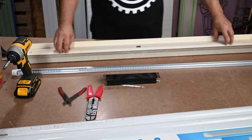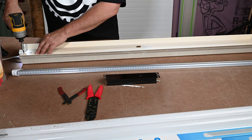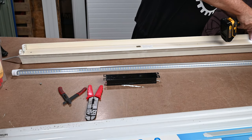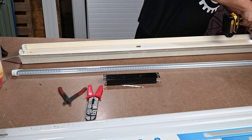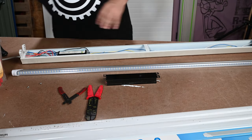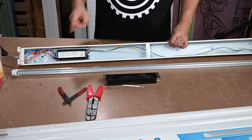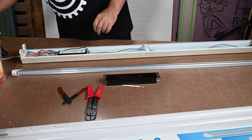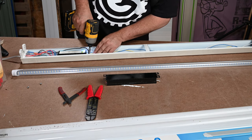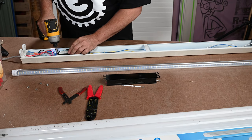Okay, then we have this metal shield here that we have to remove. Should just be a couple of screws. And this metal shield comes off, and we can see the ballast right there. So we need to take that loose — just a couple of screws.